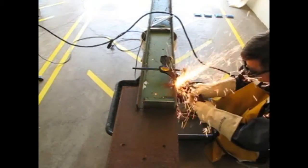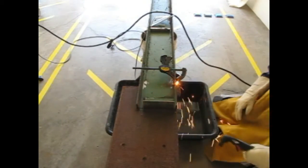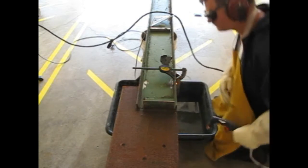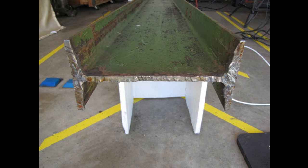I moved back and tried to cut the center again — you can see the large glob of molten steel on the side of the beam. After analyzing the problem, here's what I think happened: the steel gets considerably thicker the closer it gets to the center. As I'm moving upward, I need to slow my cut down. At the center, this steel is more than 5/8 inch thick, and my plasma cutter is only rated at 5/8 inch max — so I'm asking my tool to do more than it's designed for.